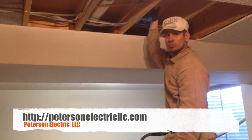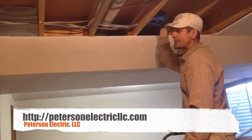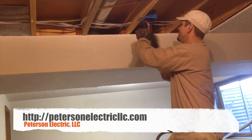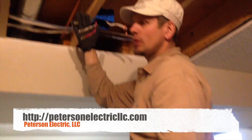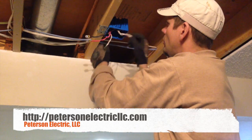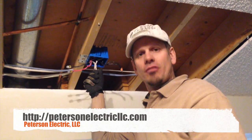You never want to keep splice boxes above drywall. When I was feeding down the other switch leg in the laundry room, we found a splice box that somebody had buried above a drop ceiling they put in — they covered up a splice box. It's important to have this below drywall so if we ever have to trace it, we know what's going on. For more experienced folks: we have neutrals coming in — this is a 14-3, which could be a traveling system or smoke detector, but in this case it's a ceiling fan: fan, light, and neutral. You don't want to mix circuits — if this were circuits 13 and 14, the neutrals would be shared, the arc fault breaker would trip, and if it's behind drywall you're never going to find that splice.